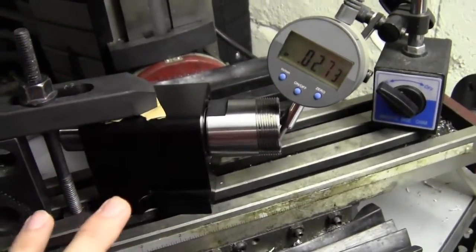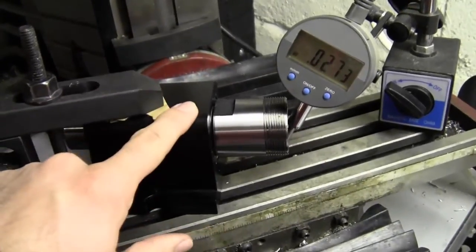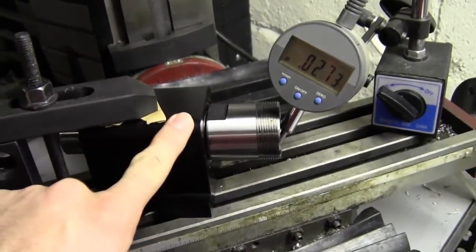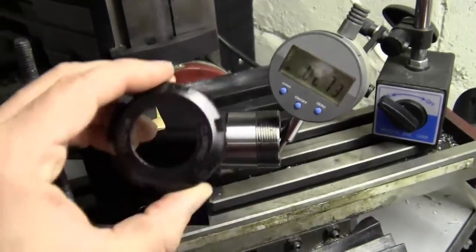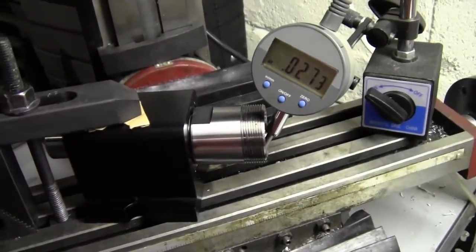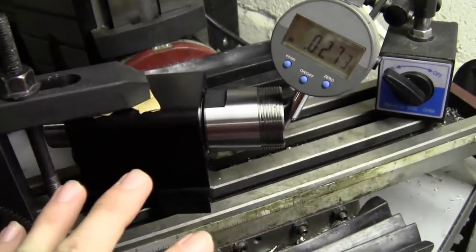In a normal basic kit — if you just get our bare bones kit where you want to use your own headstock — you're going to get the spindle, the spindle nut, the spanner for tightening it, and the bearings, and you'll have to press all that in yourself.